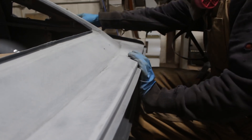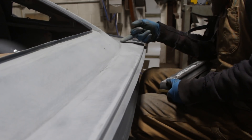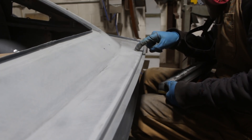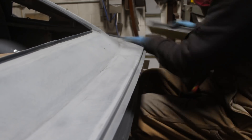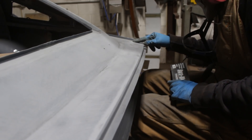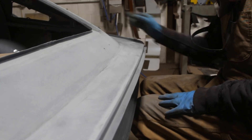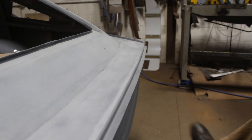I can definitely feel from here to here it is like that, and maybe there is a seam here. Looks like this piece and this piece are one, but there is a seam here. I'm going to keep sanding to bare metal so I can try and shrink this, because I can see something forming. Obviously with hammering it's not going to work, but we'll try the shrinking disc, and if that doesn't work I'm not going to bother too much with it.